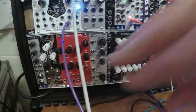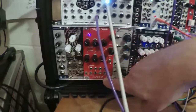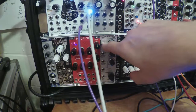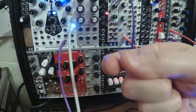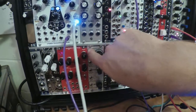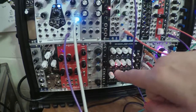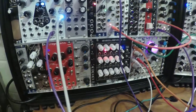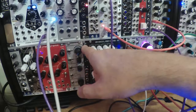Some of this rearranging was for strictly structural reasons — it was kind of like solving a puzzle, which modules will fit next to which other modules. The M669 cheated a little bit, and the pots at the edge stick out just a hair's breadth past the edge of the panel. Most modules are actually slightly narrower than the panel, but some of them, particularly the 2 HP ones, completely fill that 2 HP, so a module that sticks out you can't put next to one of these.